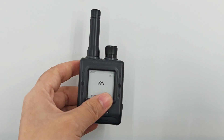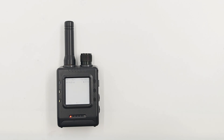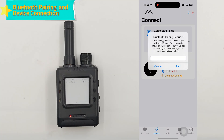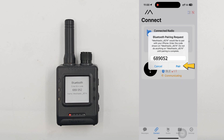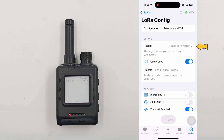You can download the version suitable for iOS and Android systems from the official MeshTastic website. Turn the black knob on the side of the device clockwise — a click sound indicates successful power-up. Wait 10-20 seconds until the front EPD screen lights up and displays status information, then startup is complete. Launch the MeshTastic app on iOS, available for download from the App Store, and grant Bluetooth access. Tap Connect at the bottom to let the app scan for devices. Select MeshTastic D574 from the list to start pairing. Enter the pin code of Thinknode M5, tap Pair, and wait for the app to indicate a successful connection.